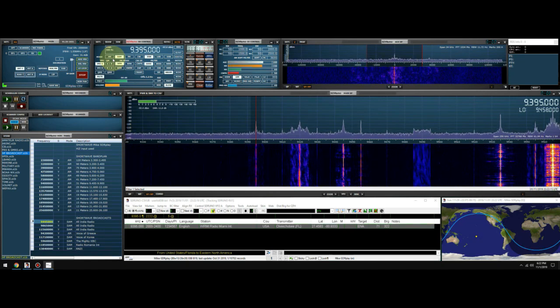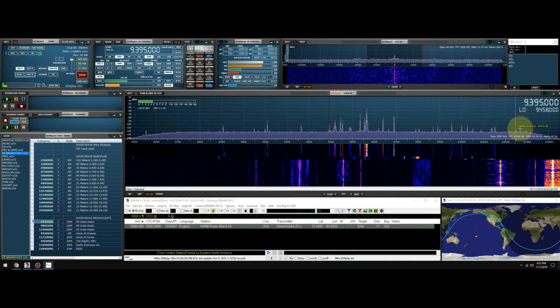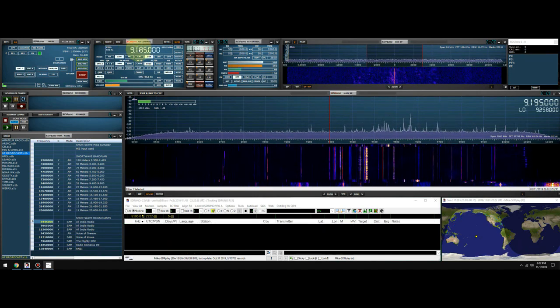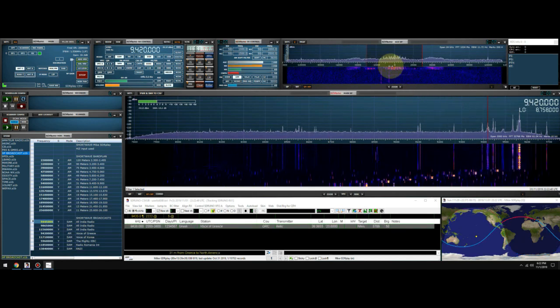Once it does turn to complete darkness here, I'm going to do another video, and the bands should really come alive. But it's 6:22 Eastern Standard Time, almost gray line. 31 meters is looking really good, and we had some stations on 20 meters. I've got a nice linear noise floor here, roughly at about 128 dB all the way throughout — it's pretty linear. The Mega Loop FX is a pricey antenna, but it's fantastic — it really brings in those weak stations. If you guys have any questions or comments, leave them in the comment section. Expect a lot of RSP-DX videos. Love this radio, and I'm not just saying that because I work for the company — it's a really good all-around Swiss Army knife SDR radio. See you guys in the next one. 73.